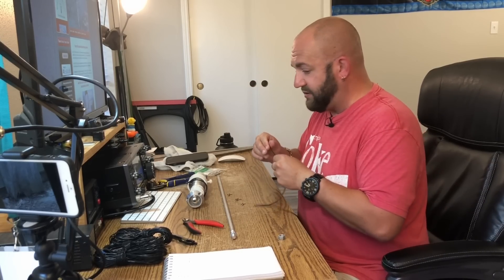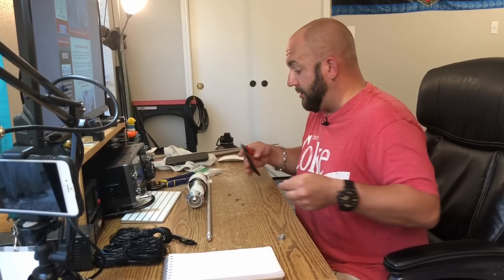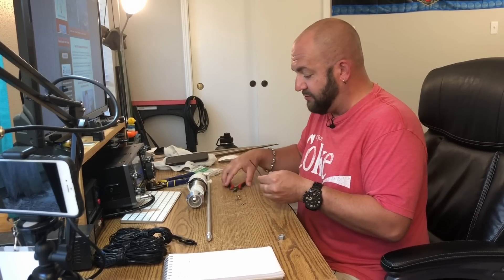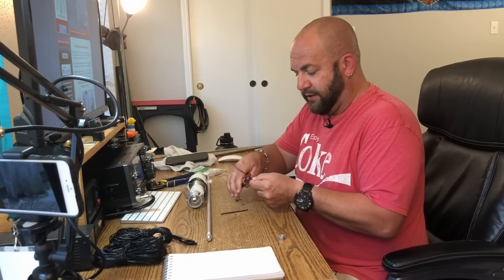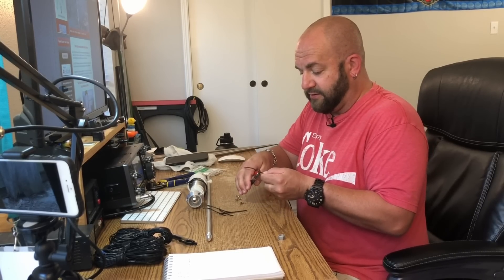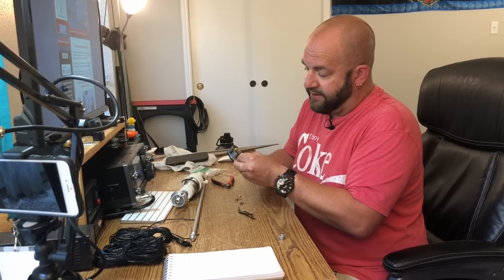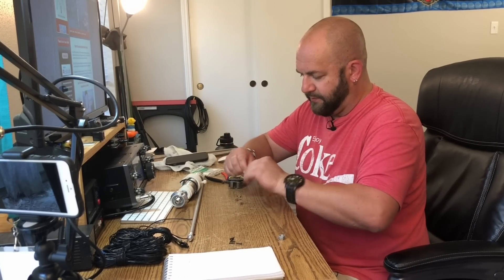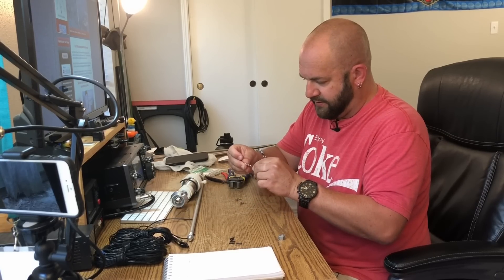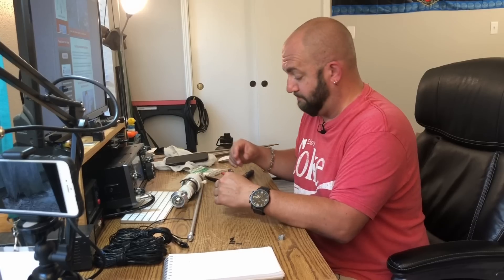If this works, I'll cut 15 two-meter radials, still equating to 30 meters of wire total. I want to see if I can cram five of these into a ring terminal — I suspect I can, but we need to sacrifice some wire to find out. This is why you never throw out wire. Through the magic of editing: yes, you can twist all five together and they fit in the ring terminal. Now I can crimp, solder, heat shrink, and pretty them up, then spool off 15 two-meter lengths of wire.